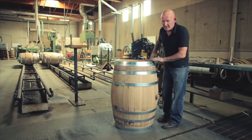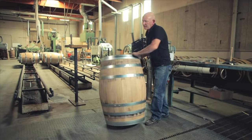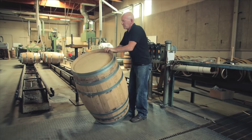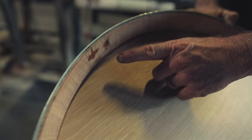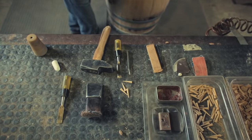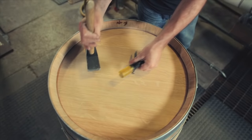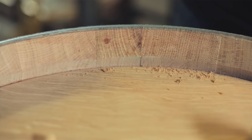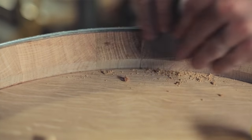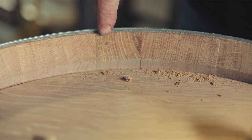First, I'm going to check the heads and around the ends of the staves to see if we can find any leaks. If not, I'll check the body of the barrel. And we have a leak. So I'll show you the proper way to fix this one. Now I'm going to scrape away the water that's leaking here, and that will allow me to see the exact point that the water is being forced through the wood.